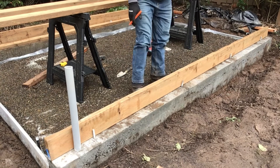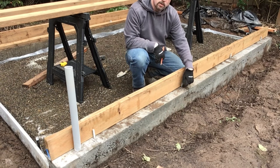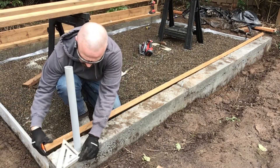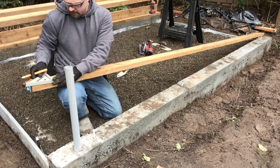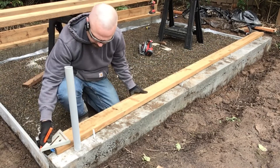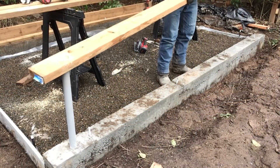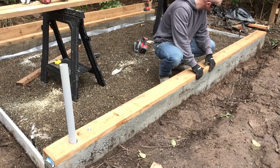You want to be sure and mark where the bolt is on the bottom. This bolt is canted a little bit because I didn't put it in straight, so I have to make sure and mark where the final hole is going to be and then over-drill it. Next, we're going to take the square and measure from the outside face of the foundation to the center — about two and a half inches. Now we're going to set it in and make sure everything fits. I drilled all the holes a little over size so we have some room to get it squared up. Looks like it fits pretty well.